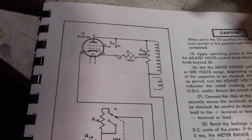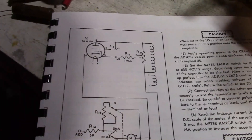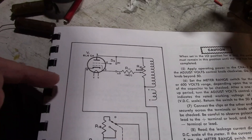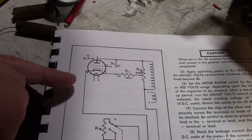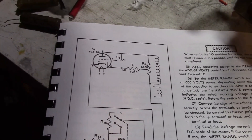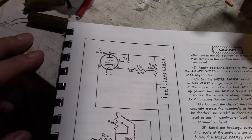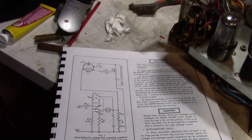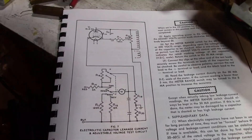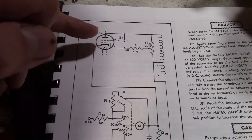I think what's basically happened — the reason it won't go below, say, 120 volts — is even with this potentiometer at one extreme, there's always a portion of the AC cycle where the grid gets a high enough potential compared to the cathode that the tube will conduct. You need to get this grid at more than negative 100 volts to completely cut the tube off when you've got 600 plus volts on the plate. It's not like a tube where you have a grid bias of minus 5 or minus 10 volts — you need to get like minus 150 volts to completely cut this tube off.